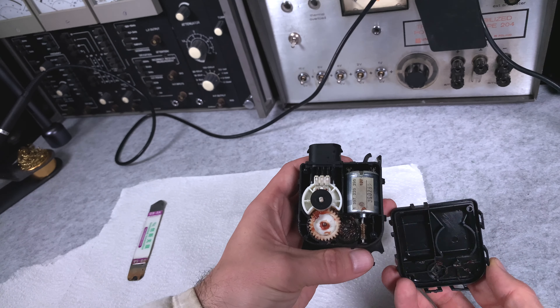This problem is so well known that for most common devices like this you can just grab a potentiometer from China, replace just that cheap part, and fix your issue. But this model I've got here has an absolutely unusual shape and I was completely unable to find a replacement. To disassemble it, you pull the motor - it slides into those two pins just like that - and now you can remove that part going upward.